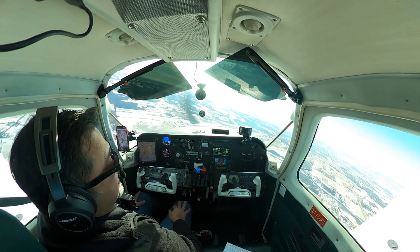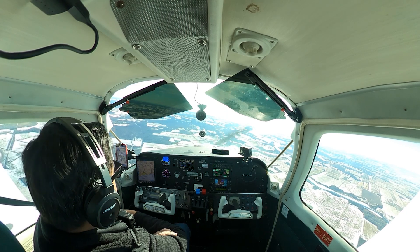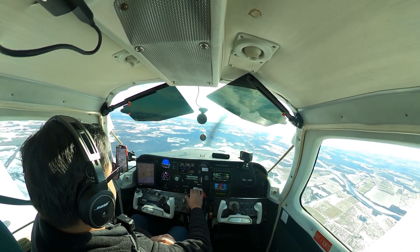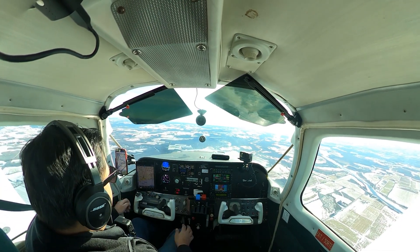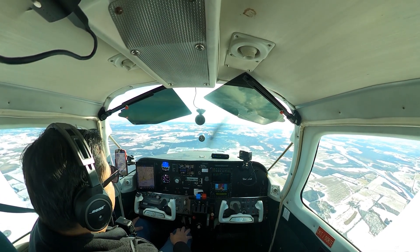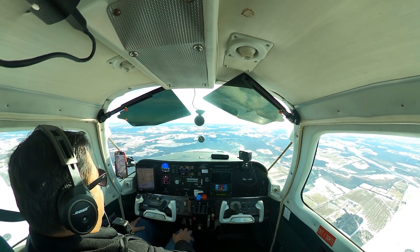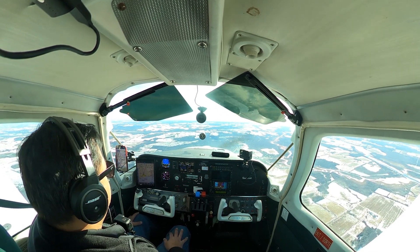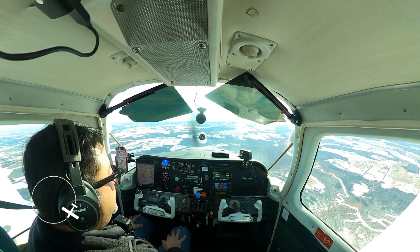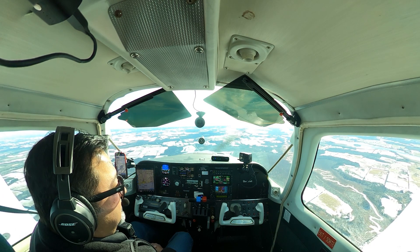Unfortunately the tests worked but the results are not what I ideally would want. The glide slope doesn't work, which doesn't surprise me — I was expecting that. But altitude hold mode really seems to be having issues. Right now I'm descending — I've descended almost 300 feet since I set altitude hold mode on. At other times it will climb several hundred feet over several minutes. This interplay between the new GI-275s and the Century III autopilot seems to be a little flaky. For now I guess I'll fly without altitude hold mode, keep it in pitch mode, and keep a closer eye on it. Maybe a year or two down the road I'll upgrade that autopilot. For now I'm going to head home to Oshawa — thank you for watching everybody, give it a thumbs up and hit that subscribe button if you haven't already.